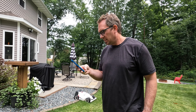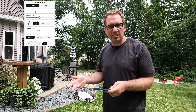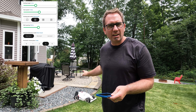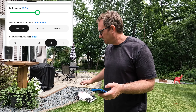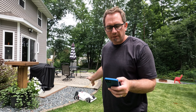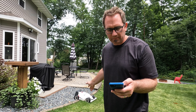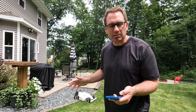I've got one test to do before I tear this thing apart and see if there's a loose wire or something. I'm going to send it on a mow job — there's an option in there for slow touch, avoid, and direct touch, and I believe that's to set the sensitivity of those ultrasonic sensors or turn them off. What I'm going to do is select direct touch, which means it uses the front bumper to sense obstacles instead of the ultrasonic sensors. If that works and it cuts without beeping, that means we've got something going on with the ultrasonic sensors.